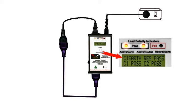The earth resistance is less than 1 ohm, so we have a class 1 earth resistance pass. Although an extension lead is an earthed device, the standard requires the more stringent leakage current test at class 2 level, which is less than 1 milliamp — and it passes.